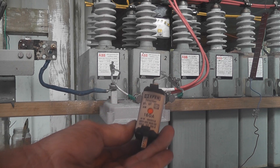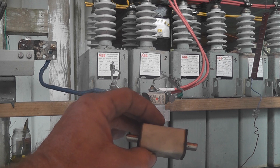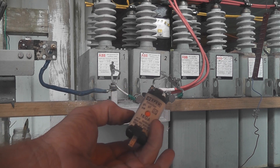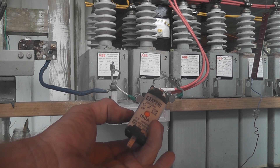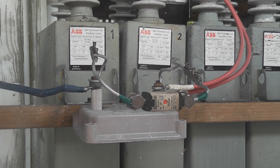I'm going to try to pop one of these 160 ampere fuses — it's got blade connectors on it. I'm just going to put one in the clips on the capacitor bank and see what happens. I have a little bit of 8kV on it.